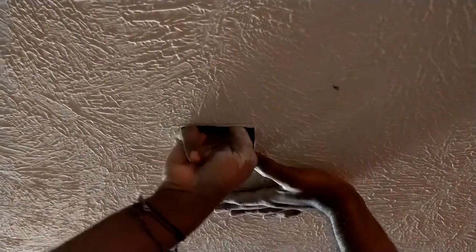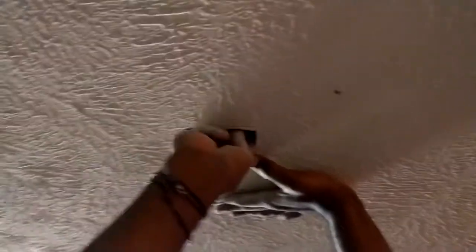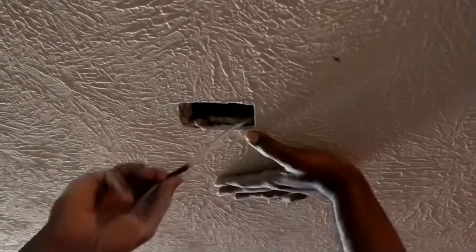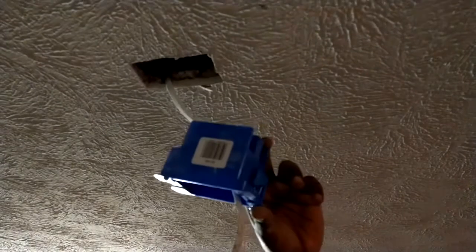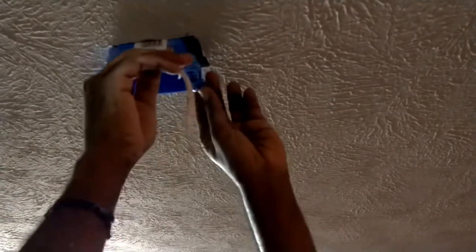Got it on the other side — there's the wire. So we have most of the stuff done. The cut is perfect, the stud is right there, so we can mount this, pull the wires into the box, and it should fit perfectly.